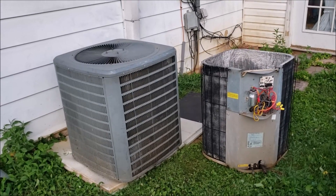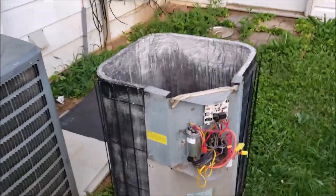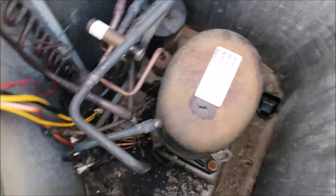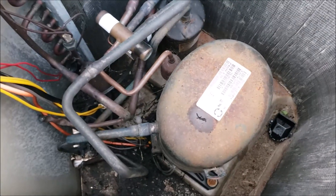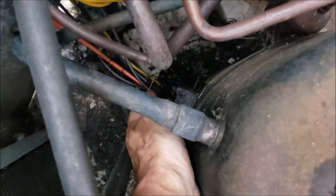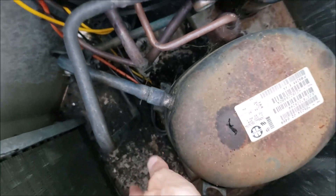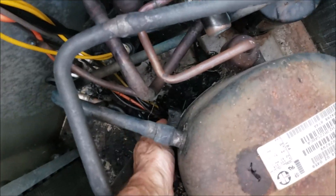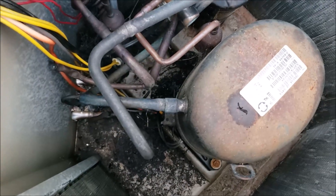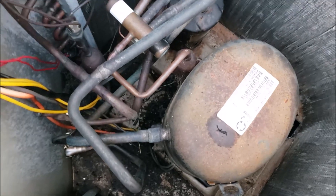I'm doing a little experiment over the next two days. I had this probably 20-25 year old Goodman that crapped out on me. The compressor still runs, but it blew a terminal out. Way down in here you can see one of the wires is just loose in the fitting. So it runs, but it just sucks air right through this hole inside the compressor because that terminal has blown out. That's kind of an odd failure - I hadn't seen that before, and I don't do this for a living.